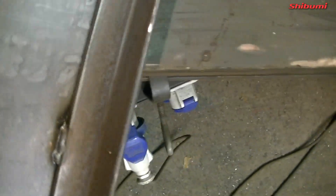I'm just about to run out of battery there. I've got all four bits done, completely welded along each seam, and the welds are all perfect - more than adequate for the job to keep in a bit of diesel. I'll flip this one now while they're still hot, just a couple of tacks, and I'll clean all that up on the inside. I might weld that inside seam yet - I can literally fly along it with the MIG gun - but I'll see. There'll be primer going in there anyway, so they'll all be closed off either way. I think I have enough done for the day - happy with that.